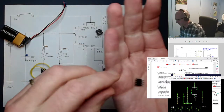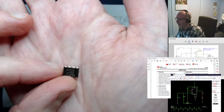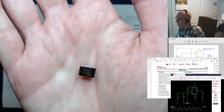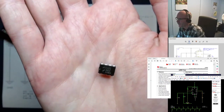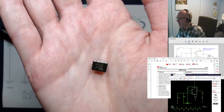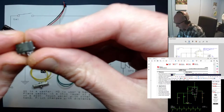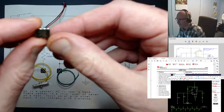These chips are all what we call a dual inline package. If they're packaged in plastic, you'll sometimes see them referred to as a PDIP — plastic dual inline package. There are also older-style chips listed as CDIPs — ceramic dual inline packages — because they had different ways of packaging them.